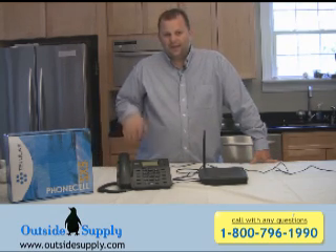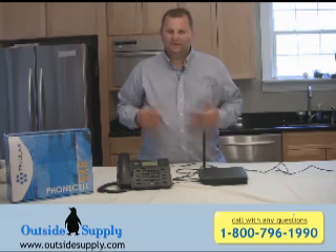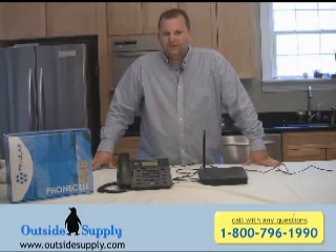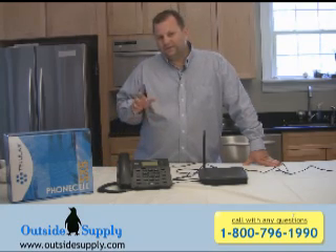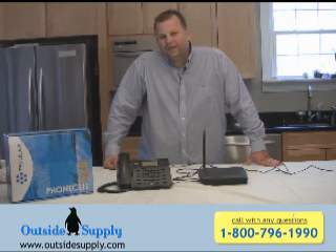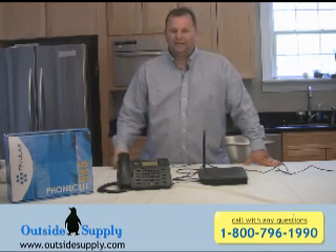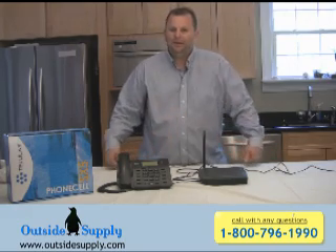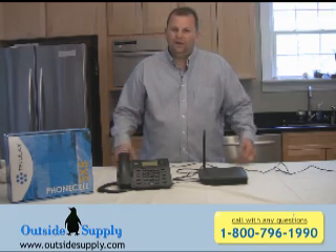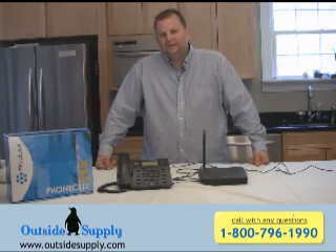Now, one of the things to keep in mind is that with the cellular, you do need to have GSM service. This SX5E does require an active GSM connection — if not, it just won't function. Now, the faxing service is a little bit different. GSM services may or may not support faxing across different networks, because faxing is not as common on the GSM network. So one of the things you want to discuss with your service provider is: do you support faxing? And if so, how do I get it implemented onto my SIM? Usually that's a service on the switch side that they will implement to allow you to receive fax calls, and it usually involves using a separate number that will be assigned to your SIM.